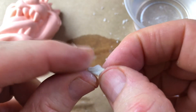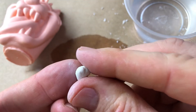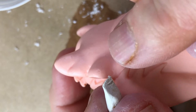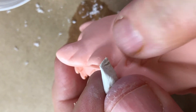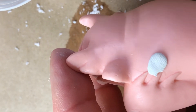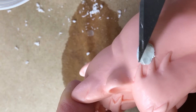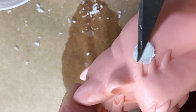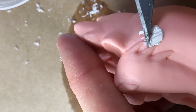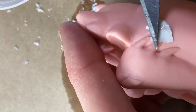It'll start hardening in about 20 minutes to half an hour; after about an hour it's pretty tough to work with. On this side of the casting I don't want to scrape because I would have to scrape down the hair and re-sculpt it. So I want to build up the low side instead. My parting line isn't as far from the hair as I would have liked — it would have been better about a quarter inch away from the ends of those hairs — but it's pretty minimal.